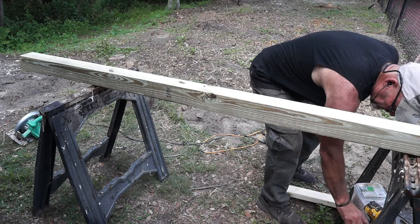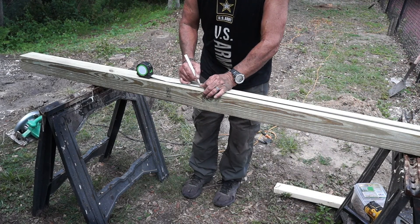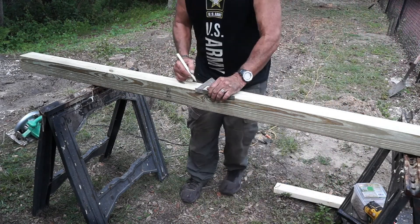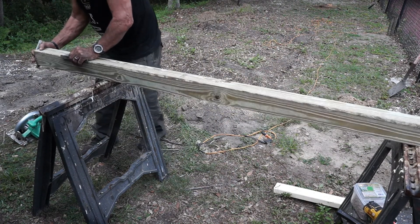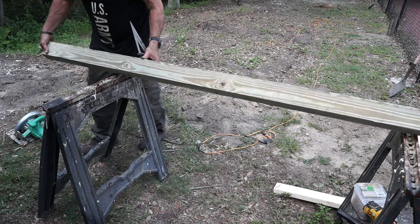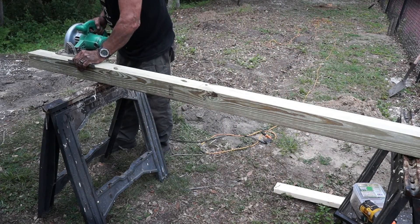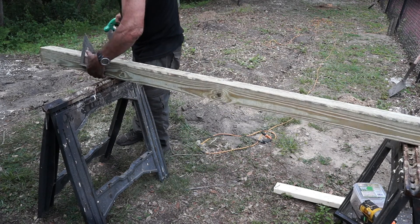Now I'm going to take a new 4-inch by 4-inch by 8-foot long post. I'm going to measure down 54 inches because that's how much of the post I want out of the ground, and then cut off about six to seven inches off the bottom of the post because my holes just are not dug that deep. This will allow me enough room to fit the post within the hole at the current depths at which they're dug out, so I don't have to dig them out by hand. I just dug them as deep as I could with the auger, and it's just easier to go back and cut the ends off.